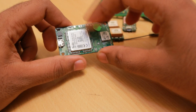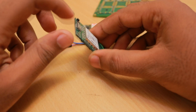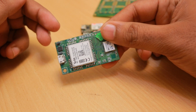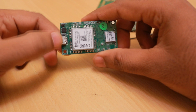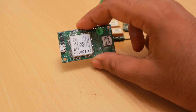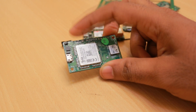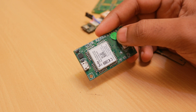But again it had the same problems — it gave out 4.4 volts, or whatever the battery voltage was it directly passed it on to the circuitry. If the battery voltage is 3.7 volts it uses 3.7 volts, which was okay when the device runs from battery. But when you plug the charger into the USB port the device gave out 5 volts directly to whatever was connected on the USB input. So this chip directly gave out 5 volts to the circuitry and the GSM module — everything was getting hot. I found in the datasheet they mention different output voltage variations for this chipset, but even after selecting those there was no proper output voltage regulation and no voltage divider resistors to set the output voltage. I discussed this with Microchip and they said this is not out of spec — the device is designed to give the battery voltage when the battery is present, and when the charger is present the output just follows whatever the charger input voltage is.